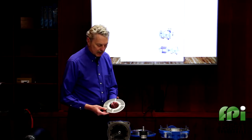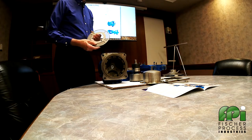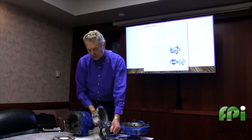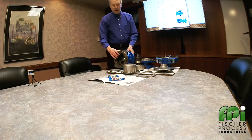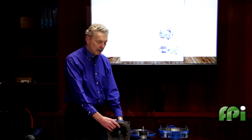The pump includes a screening device to minimize any solids getting back into the magnetic drive, and there's a good reason for that. This is inside the can and you have very close running clearances. Solids in the back can tend to block the pump's internal circulation and lead to bearing failure and pump overheating.